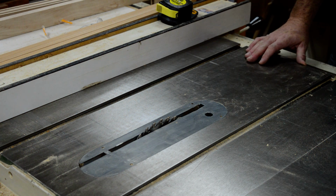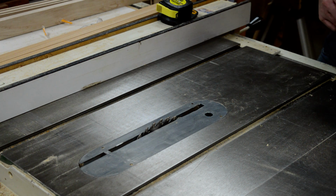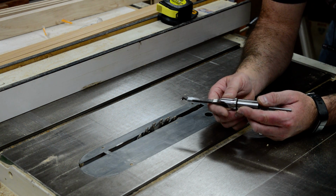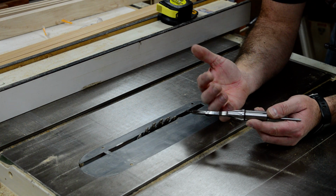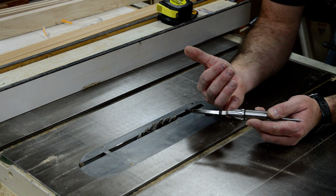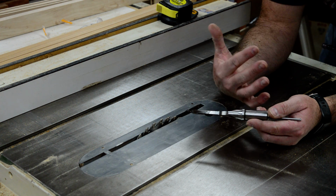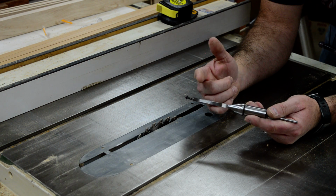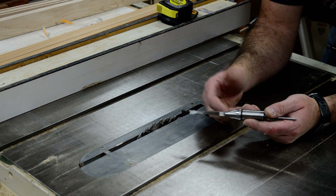And then the last piece that I need to have on hand is for making the corresponding mortise for this joint. There are a couple different ways of doing it. Drill press, you can use horizontal mortisers, multi-routers, or even a handheld router jig for mortising. But I have access to a hollow chisel mortiser, which is going to make my life a lot easier for doing this.